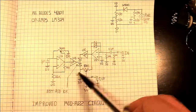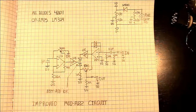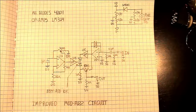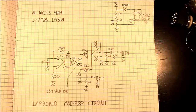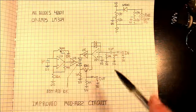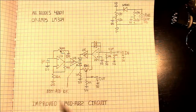And right here we have the mixer. Now, if you notice, I made a little change here. The mixer I had originally was 200K, but it was causing a lot of attenuation when crossfading between the two. I noticed this especially when I'm using my audio interface, so I put a 50K resistor. I might have to change it back to 200K, but yeah, that's the whole reason why I originally had the output buffer here. But you can see all 4 op amps are consumed, so yeah, it's not very good.